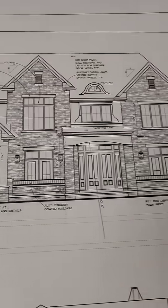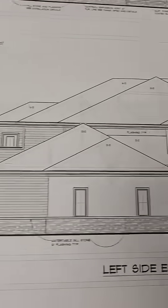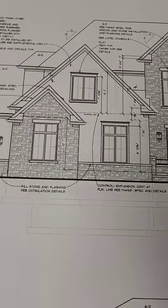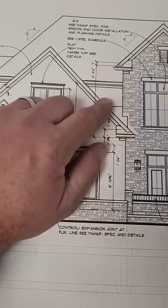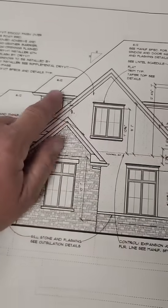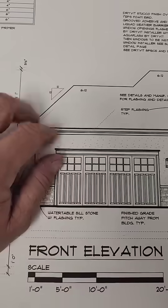So we have a roof to cut. As a framing carpenter, I like to start with my elevation views, as you can see here. Looking at these, I can notice different wall heights as well as multiple pitches called out, and then my fascia or any of the cornice work that needs to share multiple pitches.